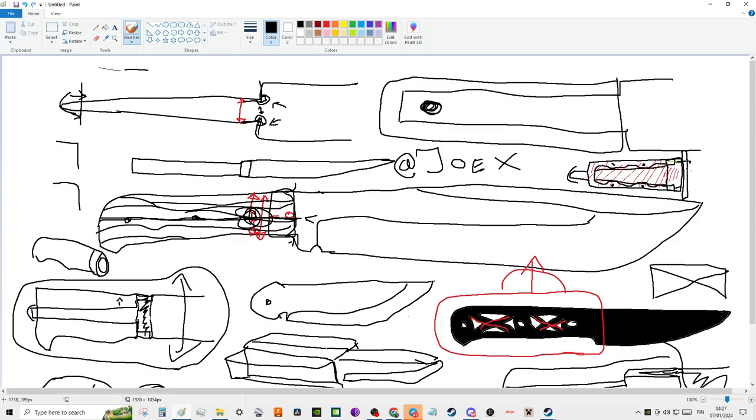So the tang goes through here, and there. And what's nice about this is that you don't have any holes in your tang. You can pin it all forwards and it's stuck and it pushes that guard and pushes everything really nice and tight against the ricasso, against the shoulders here. And you can have all these pinholes. And they're not in the center of the wood, they're on the top and bottom, which might actually be better in some cases, but the key thing is you actually can fit a ring now at the front too.